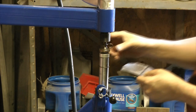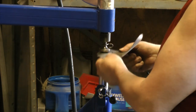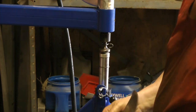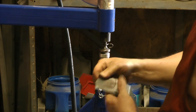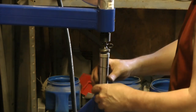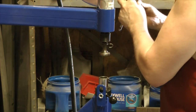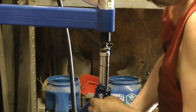I just learned something on this hammer. I was putting this thing up here and just letting it easily ride in the jaws. Towards the end, I started pressing down, and the finish got much, much better. So let me change the die. Put the number 2 die on it, see if we can planish it out a little better now.